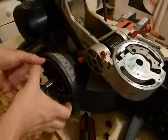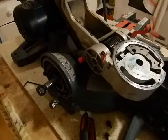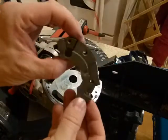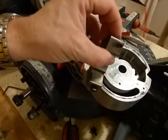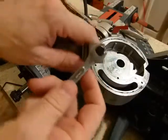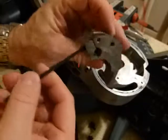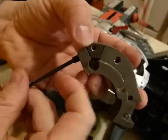This part of the miter saw is mounted here and rotates left and right 45 degrees. The heart of the adjustment mechanism is this block here, which has an interesting profile. You can see a bolt on the underside and another one on top. This one needs a 10 millimeter wrench — that's important because it will be accessible when assembled. This bolt here is adjusted with a 3 millimeter Allen key or hex key, and as it advances and retracts it moves this bit of metal in front of it.